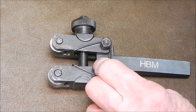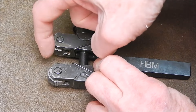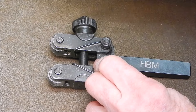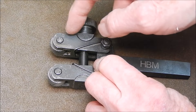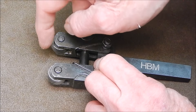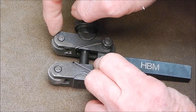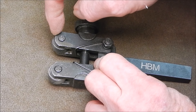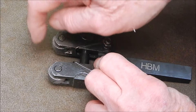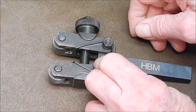Now, be aware that to use this method, the knurl arms must have clearance back from the face of the knurl — like this. This HBM is a really good little knurl, not expensive either. I've seen a lot of particularly homemade pinch knurls where the arms come out basically past the end of the roller — well, that won't work. You have to have clearance so that the roller can contact the job when the jaws open out. That's the only proviso to doing it this way.